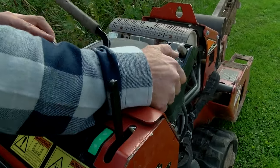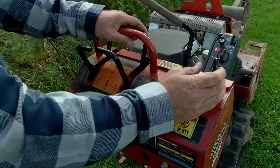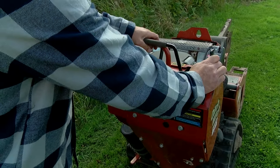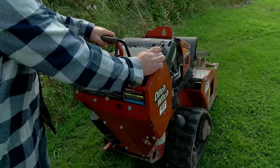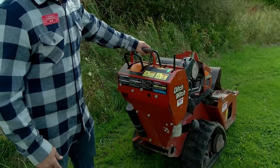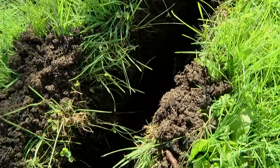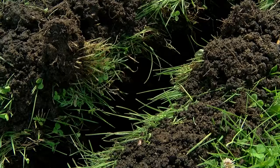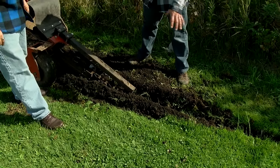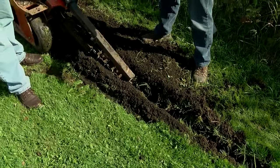It's turnkey — full throttle. That's your boom. To engage, just use the lever, and then you simply go backwards. As you can see, that's incredibly simple to dig a trench. This is pretty easy ground without a lot of rocks. This machine will go up to 33 inches deep; as you can see it does a nice three-inch-wide hole. I only went about a foot deep, but it can go much deeper than that — just wanted to give you an idea of how it works.